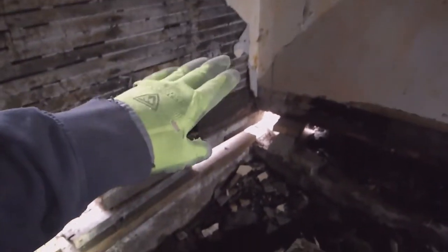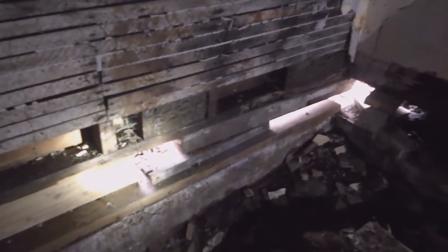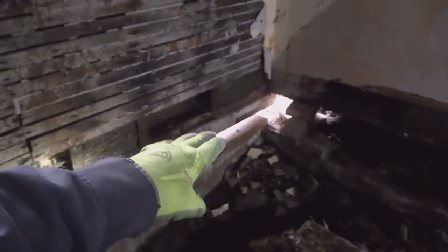So all I gotta do now is pick this up a bunch with my toe jack and put another wedge in here like this. I'll hold it up about 6 inches. So I'm gonna be working on that. I don't need you guys to watch me do any of that stuff, but I'll come back to you after I get some of that done. And then I might just clean out some more of this over here. I got to move my plywood and stuff like that, but I'm getting ready to put down another 8-foot length of sill plate right there. So we're going to do that. You guys just hang on, and I'll get back to you in a second.